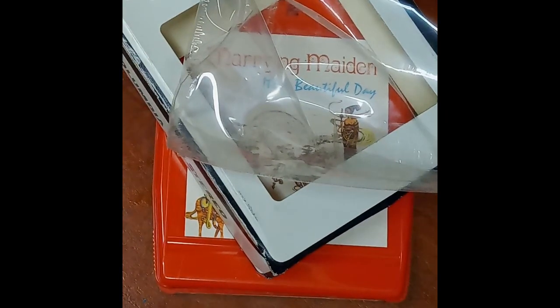I wanted to do a quick little video to show you why, in most cases, with most types of cartridges, if you get one that's new old stock, still in the shrink wrap with the cardboard sleeve, you need to open up the cartridge and address some maintenance items before either not replacing the pad and just popping it in the player, or doing the smush and push and replacing the pad without opening the cartridge and placing it in the player.